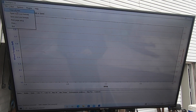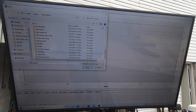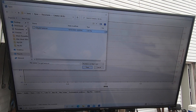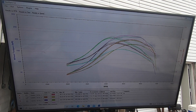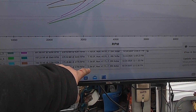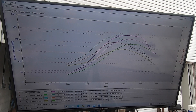I'll go ahead and open some runs — I've got tons of customers' cars that I've tuned on this. We'll start with a 1.8T GLI. I've got six or seven runs here. The dyno software is easy to manipulate — turn off runs you don't want, change the colors. The cool thing is the YourDyno box has a built-in weather station, so it records the temperature, humidity, and atmospheric pressure at the time of runs and uses that to do the SAE correction. You can turn that on and off — people love to cry about corrections.